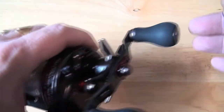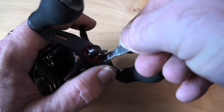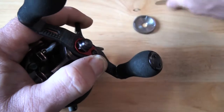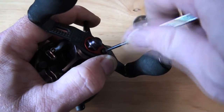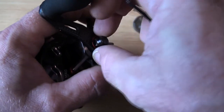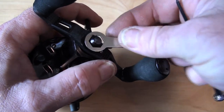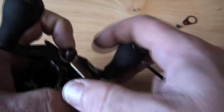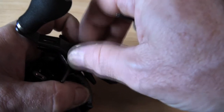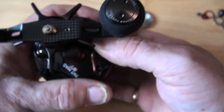And so, if we take the handle, and you have to remove the handle, and this one's quite tight because I put this one in tight a little while ago. There we go. I'll just loosen that off and I'll use the little screwdriver. Take the locking plate off, and then take your spanner, and there you go. Just give it a crack and open that up so that the nut comes off.